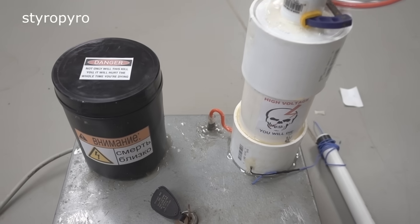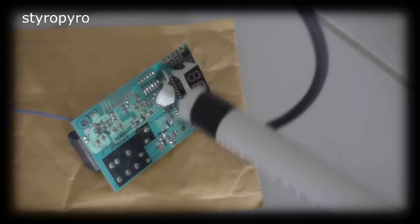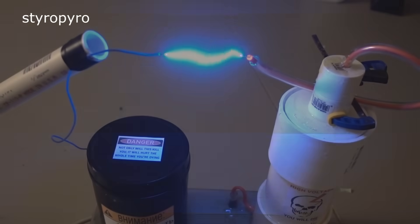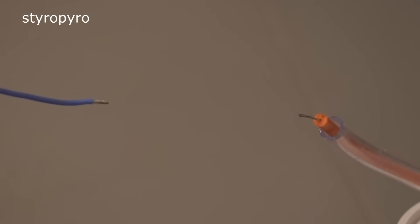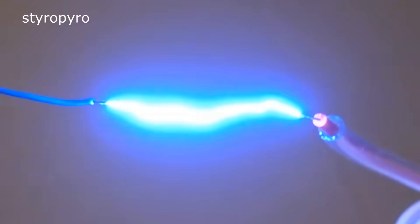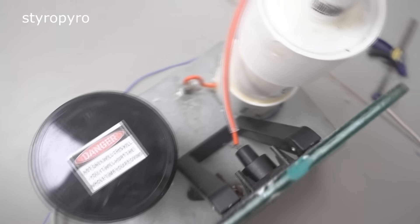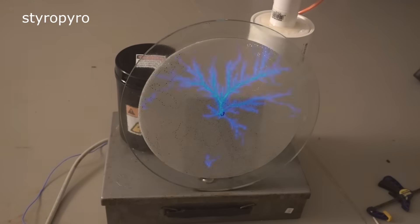I'm going to revisit the classic Westinghouse versus Edison debate and see whether DC or AC is better at powering one of these fixtures. Let's start with DC. I've been putting together a giant voltage multiplier tower for some insane DC voltages, as I have some really awesome experiments in mind. Here's my best prototype so far — it can do over 100,000 volts DC. The design is basically a verbatim copy of YouTube user Viduli. His design is unusual in that there's no output resistor, so you get these intense pulses instead of a continuous arc. I have the output of the multiplier feeding directly into the center of the fixture. Let's see what happens when I hit it with 100 kV. Whoa! Oh wow, that's freaking crazy! That looks way cooler than the original product.